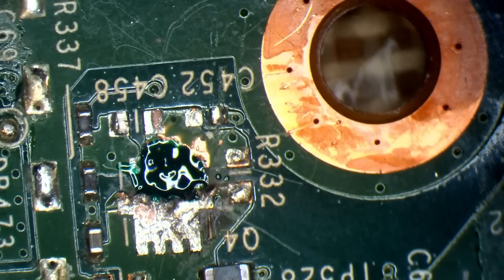The way boards are built up: you've got a top and a bottom layer, but in between you've got internal layers — usually between four and twelve layers depending on the complexity. I think these are around six or eight layers. In between each layer, because the traces are all copper, they need to be protected with a fiberglass substrate. That gray area I was digging around — that's the substrate. If that gets exposed it can potentially cause a short between two layers.